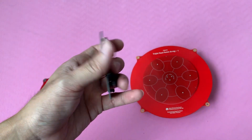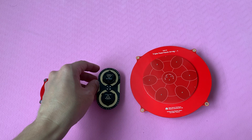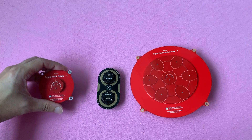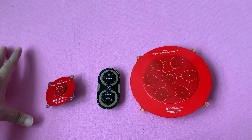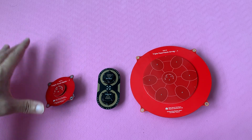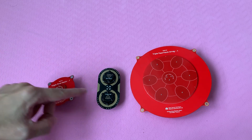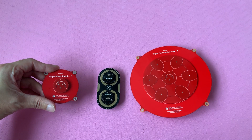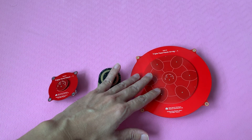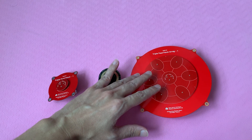I'm going to set up the BTX at the window of my house, step out, get to some distance away from the transmission source, and test the antennas individually to show how they perform in terms of penetration, which is the gain performance. Then we'll look at the two lower-gain antennas and compare them in terms of beam width. I will not compare the 14dBi for beam width because high gain antennas have narrow beam width.